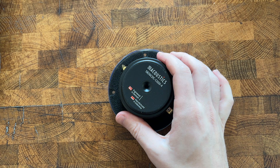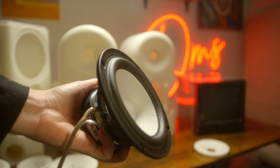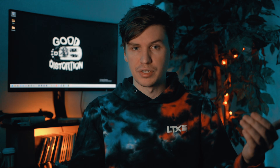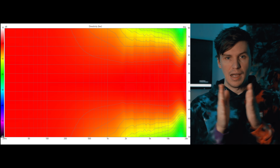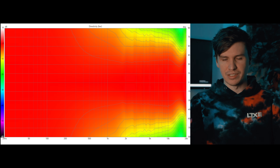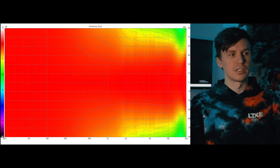For this speaker, I used a ceramic tweeter and woofer from SB Acoustics, as well as an SB Acoustics passive radiator. The design was originally ported, but we started getting much better results with a passive radiator and a custom waveguide to help control directivity. Ideally, we have directivity that's fairly controlled going forward in a relatively cardioid pattern, and it's designed to be used near field and not toed in, so you're listening a little bit off-axis. This was done with a small sacrifice to the vertical contour, but since you're listening near field, the directivity is pretty excellent.